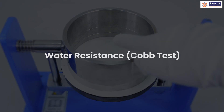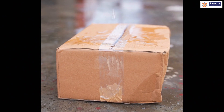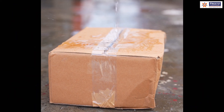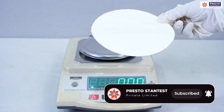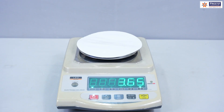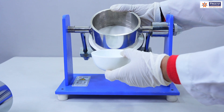Apart from this, there is a very important test — the Cobb test — to check water absorptiveness. It is important to check how much moisture or water the sample can hold. ISO 535 checks the absorbency of paper and board, which is critical for packaging in humid or wet conditions. A circular sample is made, water is poured on it for a certain duration, and the difference between the dry weight and the wet weight after absorption gives the water absorptiveness value. The higher the Cobb value, the greater the water absorptiveness of the paper or corrugated sample, making it very important for rain or high-moisture environments.